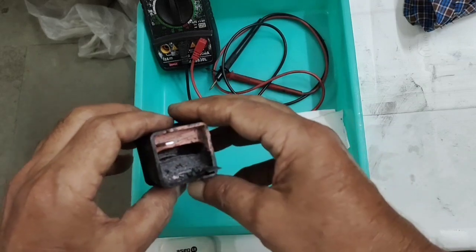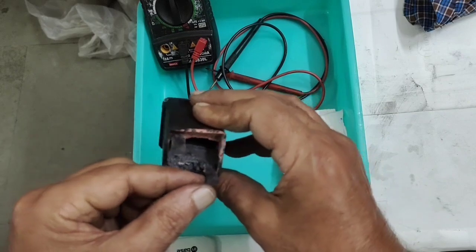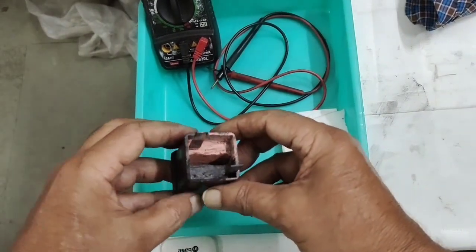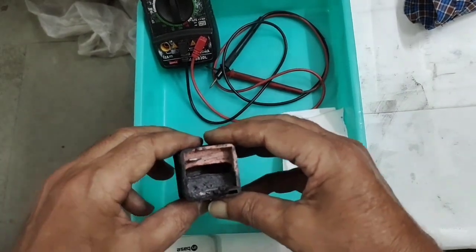So 20-25% of carbon has been incorporated into the negative electrodes, as you can see. Directly I have pasted it into the container itself — no special frames or grids — and the lead plate is incorporated directly. This is a trial cell.